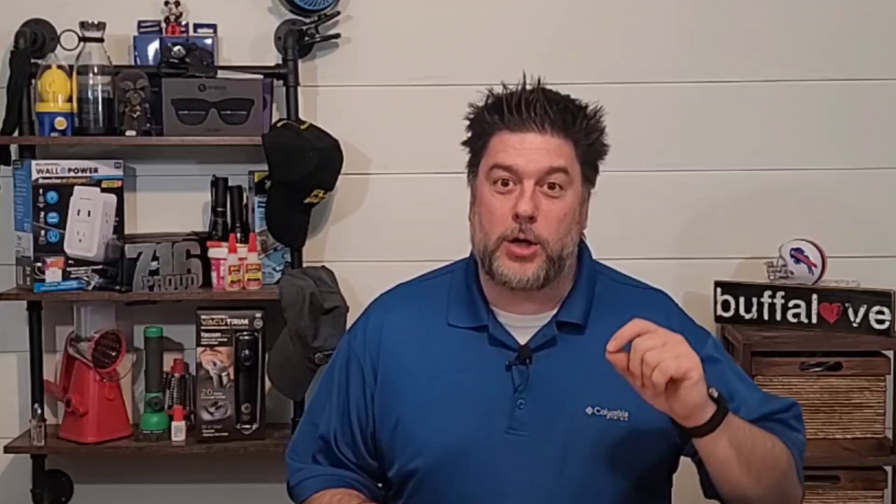In this video we did a DIY installation of a tankless water heater from Rheem. I did this out of necessity — a recent storm knocked out my old hot water tank and I'd been wanting to upgrade to a tankless system. Off-camera I built a wall and ran some plumbing to prep for the install. Once everything was ready, the entire install took about two hours — hooking up fittings, running electrical, and putting the fuses in the fuse box. After collaborating with a local plumber and electrician, I settled on the 18 kilowatt unit. My house has three bathrooms and this unit says it can run up to two showers and a sink simultaneously, depending on water temperature. My electrical box only had space for two 40 amp breakers.